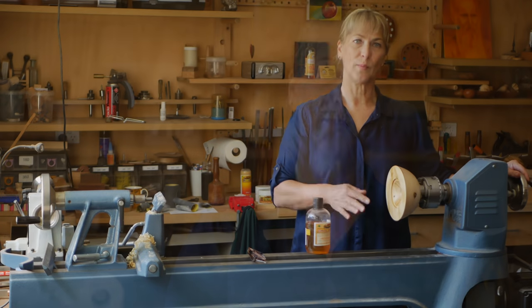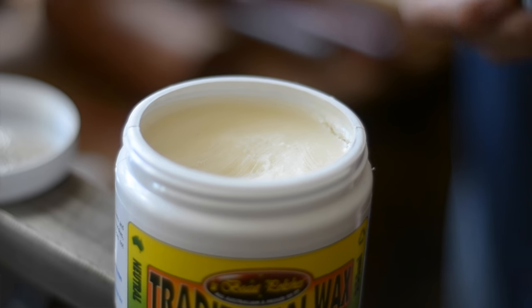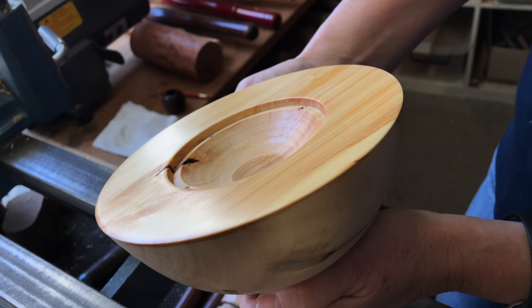I've sanded the front of the bowl to 400 grit, applied two coats of diluted White Shellac with methylated spirits, and cut that back with 600 grit sandpaper, then applied another two coats. The idea with shellac is that the more coats you put on, the richer the effect — you'll get a lovely depth to the timber. So we've put on six coats: sanded to 400, put on two coats; sanded to 600, put on two more; sanded to 1200, put on another two. When this last coat dries I'm going to use 0000 steel wool with some wax and just buff it up.